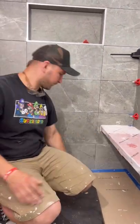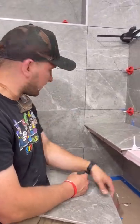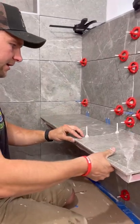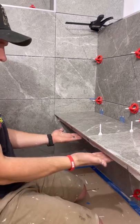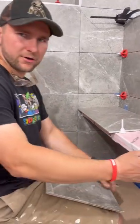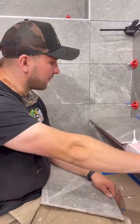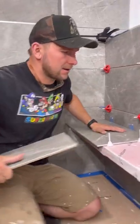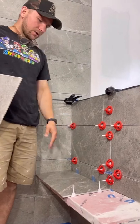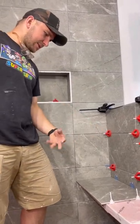Now we're going to move on to our bench. I put this piece of tile on here to figure out where I've got to cut it off, but when I put it up here it looks pretty sick. So I'm thinking — why can't I just float it out? Why can't I add this piece of tile here, schluter strips on the bottom, fill this with thinset, and then put my piece in there? The brackets I'm using here are from Aria Vent, and they are so strong that I can stand on this for days. I can already stand on this without any movement, so adding the one-inch overhang is not going to add anything. Plus it gives me a nice, clean tile with no cuts.